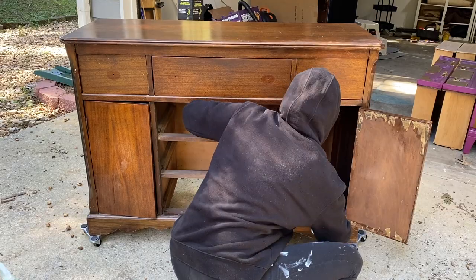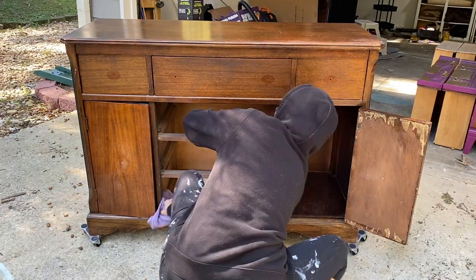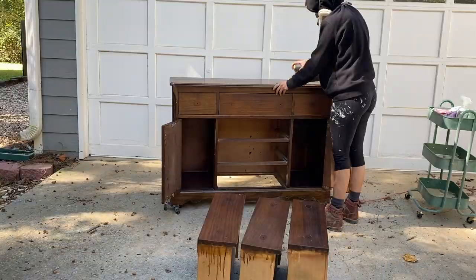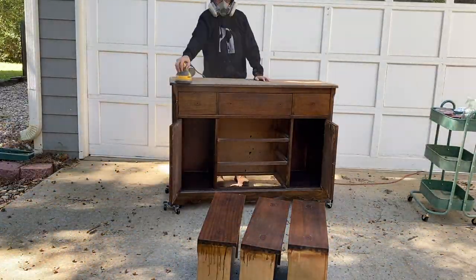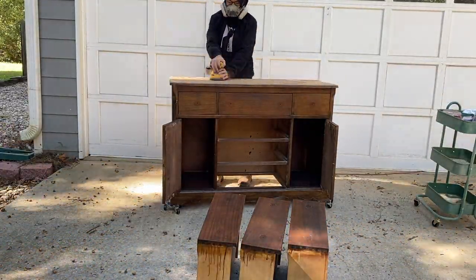There was some damage to the top of this piece, and I had to go in there and spend most of my sanding time trying to get that top layer of finish off where most of the scratches were. I spent most of my time on that and then moved on to just scuff sanding the rest of the piece.